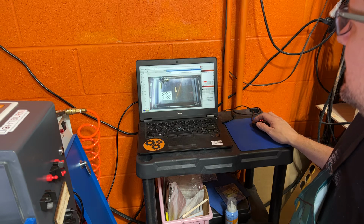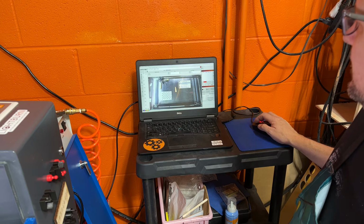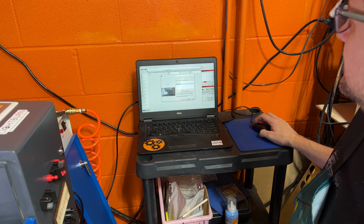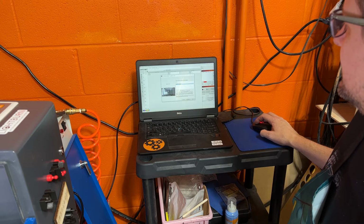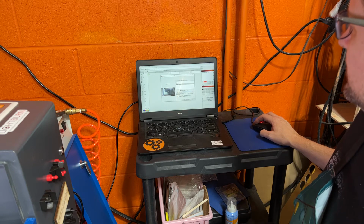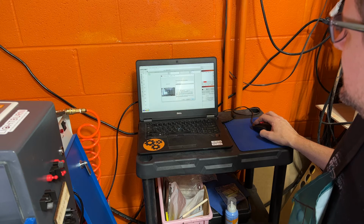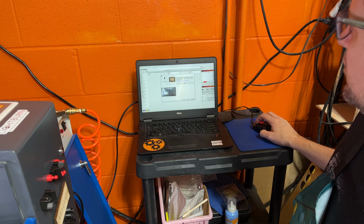You just select your camera here from the camera drop down, which I've already done. Right click, go to Calibrate Camera Lens. From Calibrate Camera Lens, I'm going to select the WN 4K camera. I'm going to select a standard lens. For the preset, I'm going to say none, do full calibration, because I've not calibrated this camera on this laser yet, even though you could presumably select one from here. I would rather just go through the whole process.